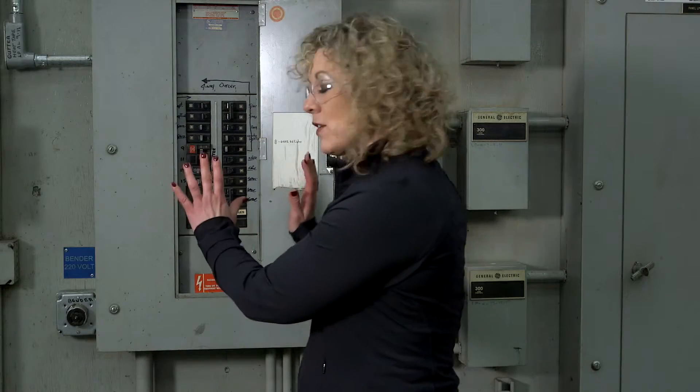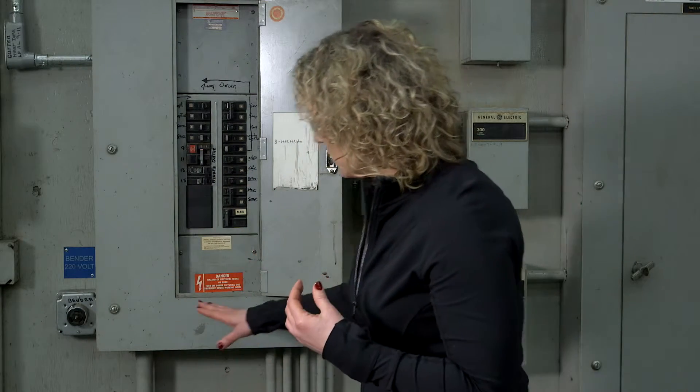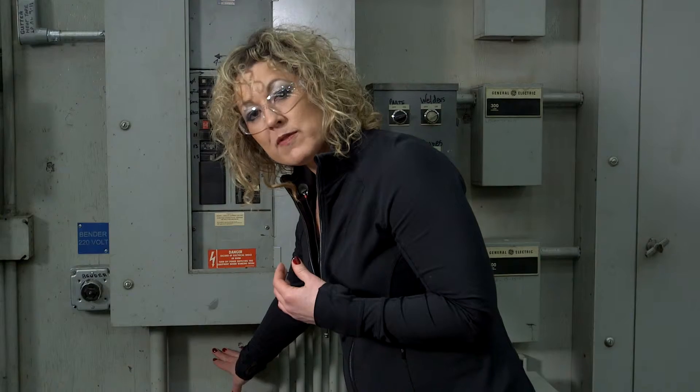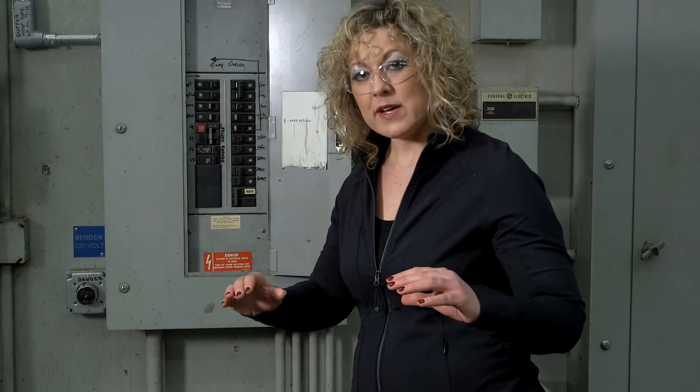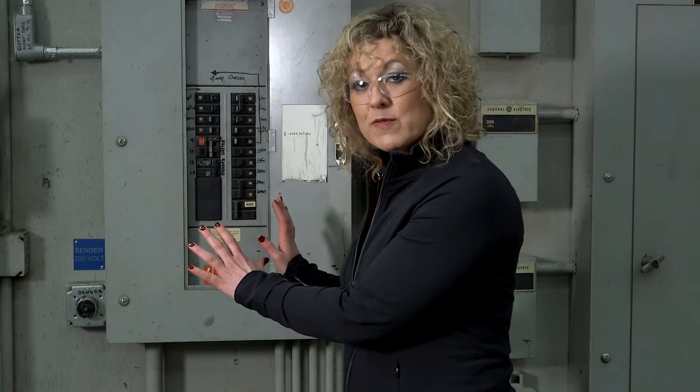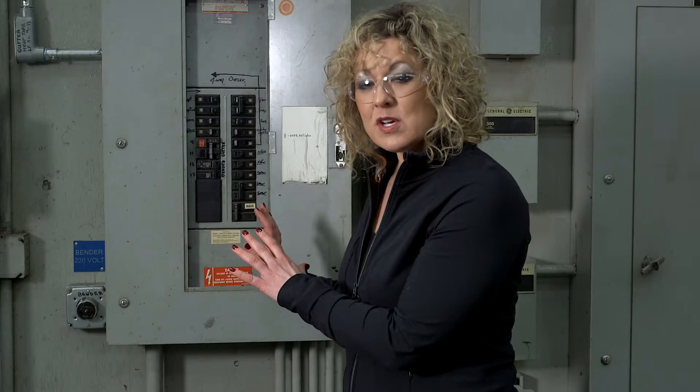Not so long ago I was doing a safety audit and I opened a panel and I could feel heat coming at me. I took a closer look and noticed there was an outlet tapped off the bottom of the breaker panel. Plugged into that outlet was a multi-strip outlet filled with all kinds of devices, and out of that multi-strip was another one, and out of that one was another one — three multi-strips coming out of one electrical panel, every single outlet full. It was causing a lot of heat in that panel, so much that you could feel it standing this far away.